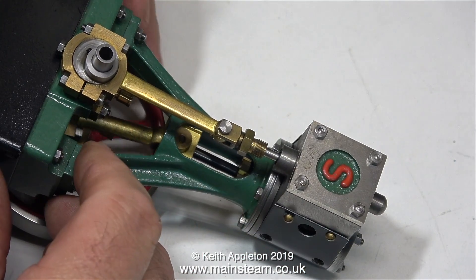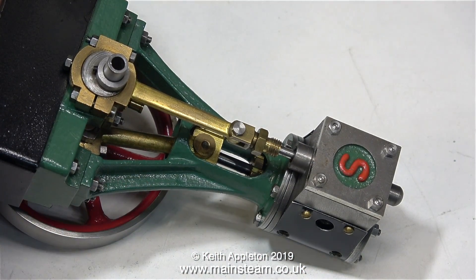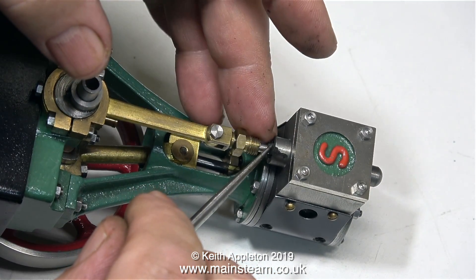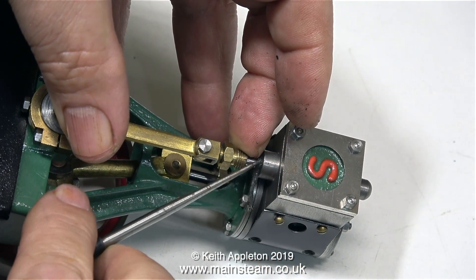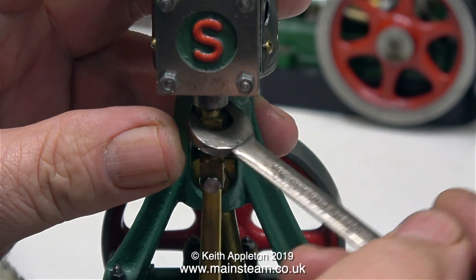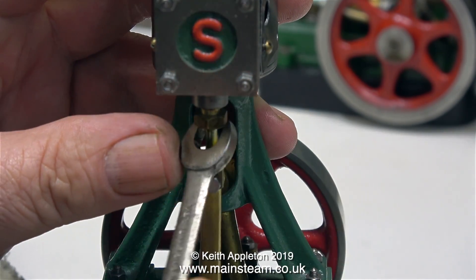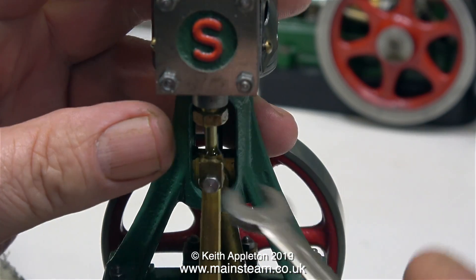It's not even oily yet, and it feels very good. The only slightly negative thing I noticed about this engine is that there was side play on the valve spindle, and when I loosened the nut and had a look, the gland wasn't packed. So what I'm doing at the moment is packing the gland using an old piece of graphited yarn. I don't like the modern stuff — it doesn't seem to be as good as it used to be — so I keep quite a lot of this old stuff in a box in a drawer. It's much denser than the stuff they make today and it seals better.